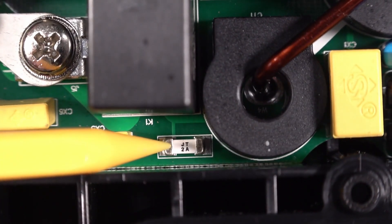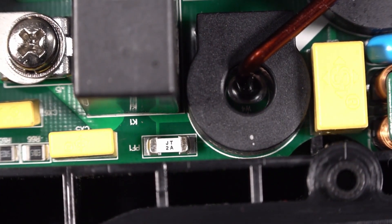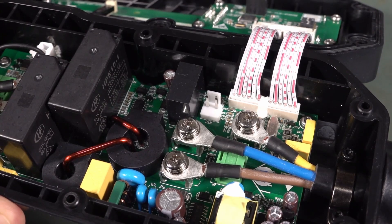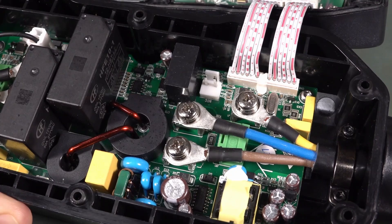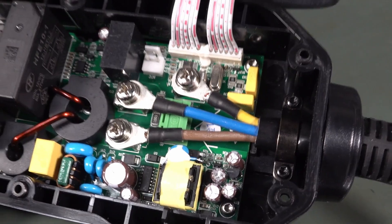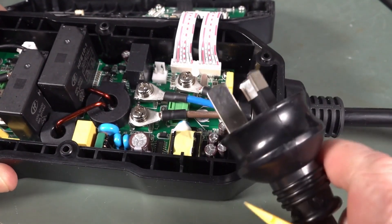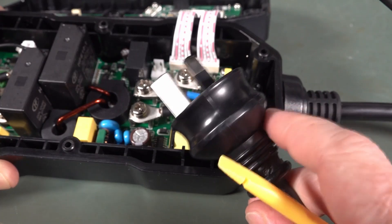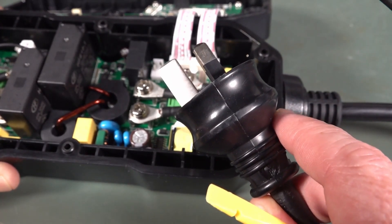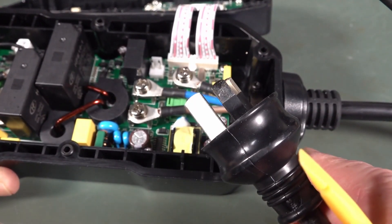The input is fused, as you'd expect — you can see that little SMD fuse down there, that's for the main switch mode from the mains input side. Interestingly, there is an NTC thermistor temperature sensor input there. The micro has probably got a temperature sensor in it as well, because I can't imagine it's not measuring the internal temperature in a sealed enclosure design like this. My guess is that in the higher-amp models — but not in this one — they would actually have a thermistor measuring the temperature inside the mains plug, because when you start talking 32 amps, that becomes a serious concern. At 15 amps, that's why they haven't got it fitted here.